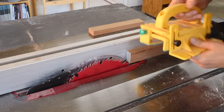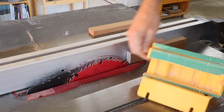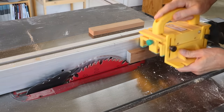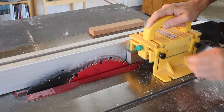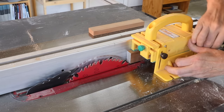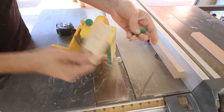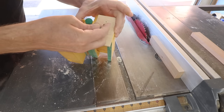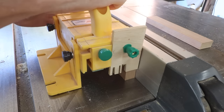I'm going to set up my gripper to assist with this cut. First thing I need to do is move this middle one over out of the way. This one's going to hold the work piece in place, but I need to keep this from tipping over — and that's what this thing here is. It'll slide down like that and then I can lock it in place. I'm also going to attach this sacrificial cleat to the back of this gripper just to help push that board through a little bit better. And that'll ride back here on the board.